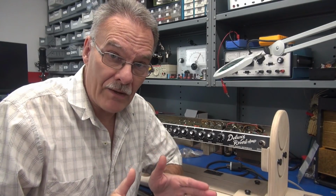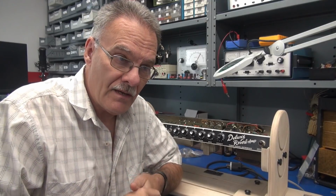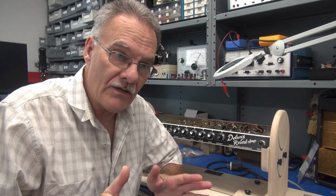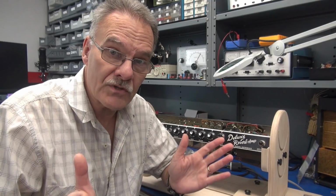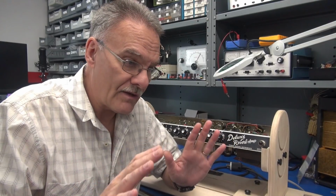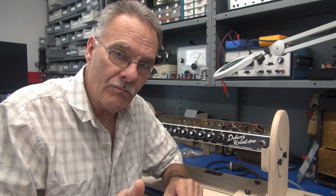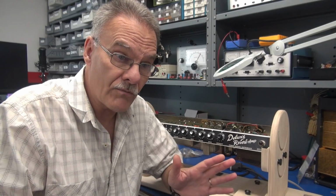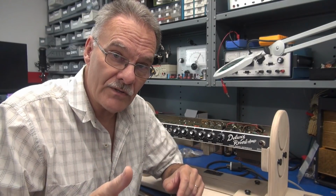I've got a tech tip for you this weekend on vintage tube amplifiers, especially if you're experiencing sudden power dropouts. A friend of mine owns this Fender Deluxe, and over the last few weeks he's had issues where he would play for hours and then it seemed like somebody just turned off the standby switch. It would just kind of fade out. He'd fool around with the power switch, move things around, boom, she'd come on and sometimes work for hours again. Well, the frequency of this problem has been increasing.